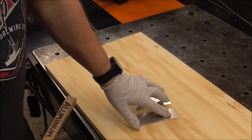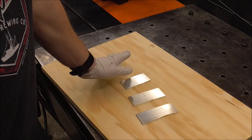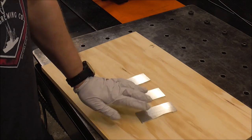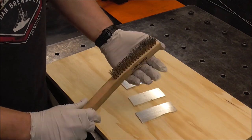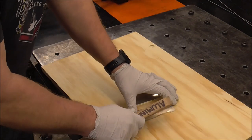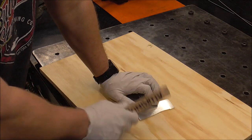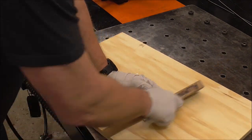Next we need to remove the hard oxide layer on top of the aluminum - basically like a film, similar to what mill scale is to steel. This oxide layer melts at about twice the temperature that aluminum melts, so it's important to remove it to get a good weld. Use a stainless steel wire brush that you only use on aluminum so you don't introduce contaminants - that's why it says 'aluminum' on it. The proper way to do it is to scrape in one direction only, so you're not kneading the oxide layer back into the aluminum.